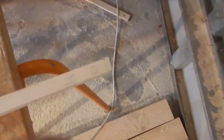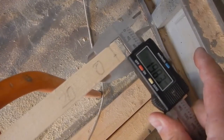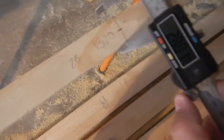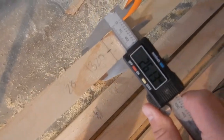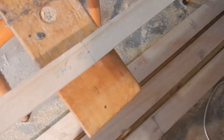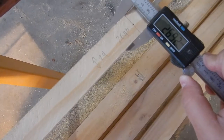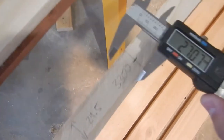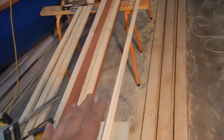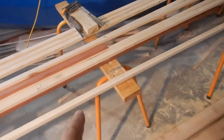I've got one of the staves cut to the correct taper. At the top the thickness is 20 millimeters — pretty much right. Coming down: 23, 23.5 — close enough — 26.13 where 26 is needed, 26.5 where 27.5 is needed — a little bit thin. Then 29 where 29 is needed, 27 where 29.5 is needed — a bit thin too. Then 30.7 and 30.87 at the bottom where 30 is expected. Just a couple of places where it's a little thin — I'll make a note so I leave it thicker on the others.